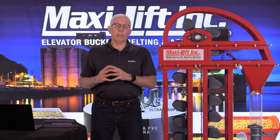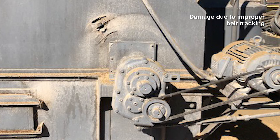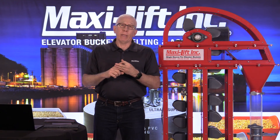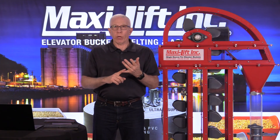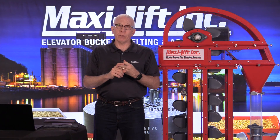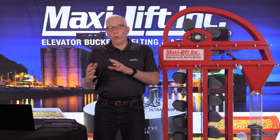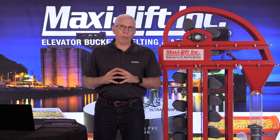The next photo shows what happens when the belt is not tracking in the middle. A belt can come all the way over to the side and rub on the head bonnet or possibly the boot. In this case you can see it rubbed in numerous places — the belt hit the side and wore down until it was gone, then the buckets came over and started wearing on the side. Making sure lagging and crown are correct will make a difference. Also notice they were missing the belt guard — that's a dangerous situation we'll cover later.